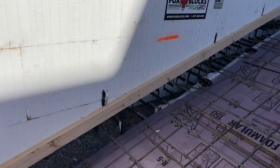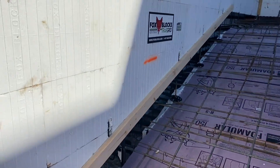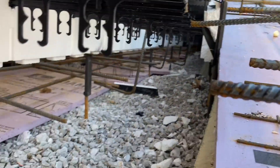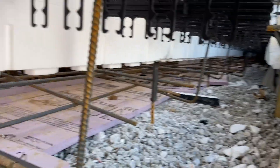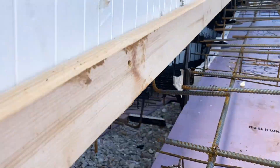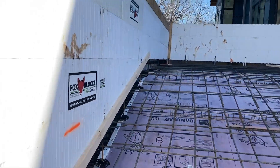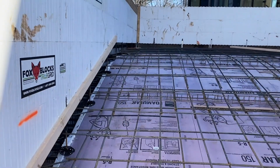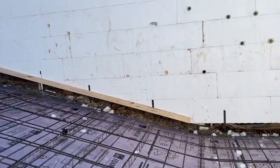From down here — this two-by-four is only on there to provide us with a perfectly straight grade, just right under that two-by-four. As you can see, the monopour has got 12 inches of concrete going under, but it walks uphill. The catch basin's flat at eight foot down. So this is three-dimensional: the wall goes up eight feet, it has a flat surface coming off that way, and then the slope floor of the pool goes this way. It honestly makes an incredibly strong shell to tie everything together that way. We've got the two main drains here.